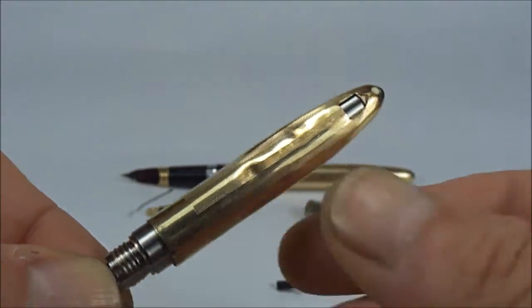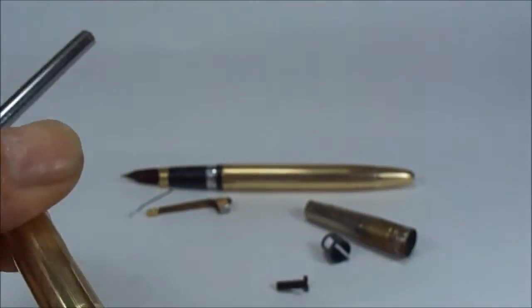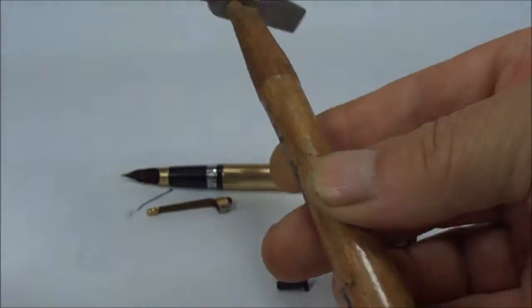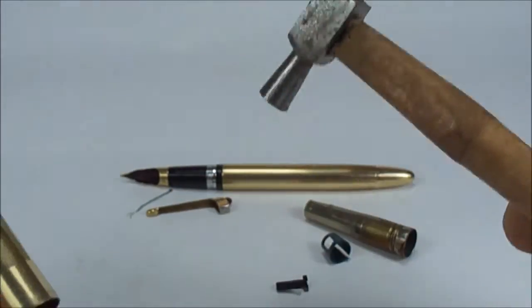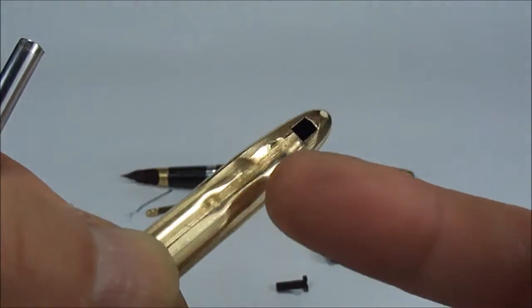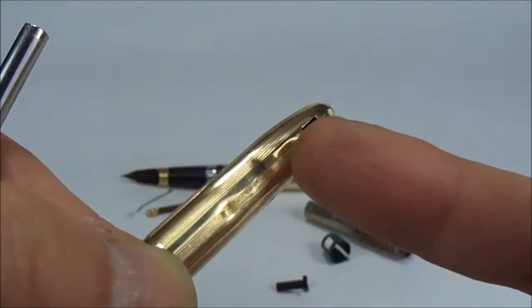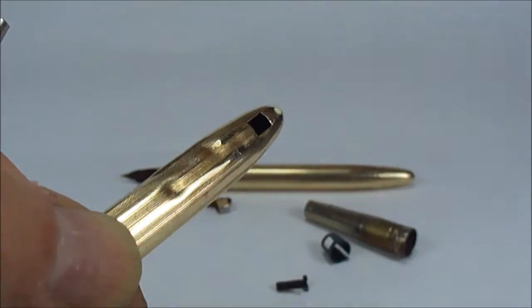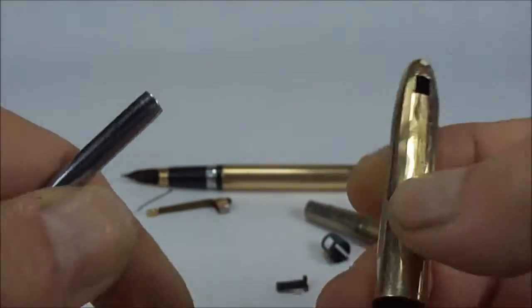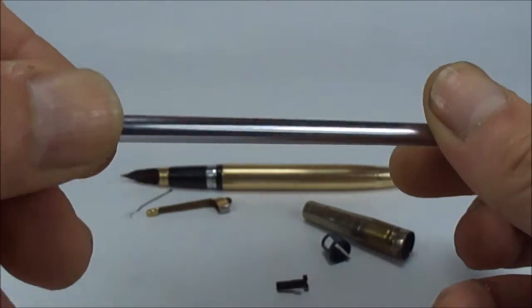And what I'll actually be doing — we'll take the mandrel out — I'll be using my little jeweller's hammer and a little piece of wood. First of all, very gently and very carefully, I'll be knocking some of these dents out. Once I've done that, what I'll do is use a bar like this, and as I say I've got several of these bars.